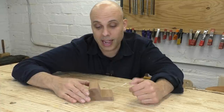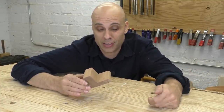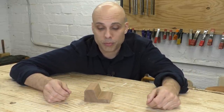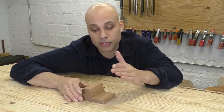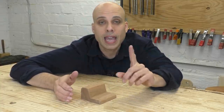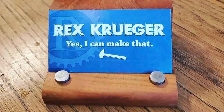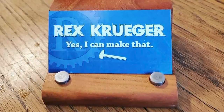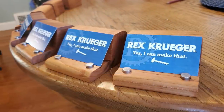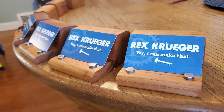The idea is very basic. I started with a block of wood, I made a pair of saw cuts — I used a table saw, but you could use a hand saw for this — and then I rounded over those edges. You could use a router or a hand plane, it really doesn't matter. And then to keep the business cards from sliding off, I drilled and inserted a couple of steel pins. The steel shined up really nicely and made a good contrast with the warmer tones of the wood. To bring out the life in that cherry, I used a shellac finish. It was super quick — it dried the same day, so they really were done when she got home from work.